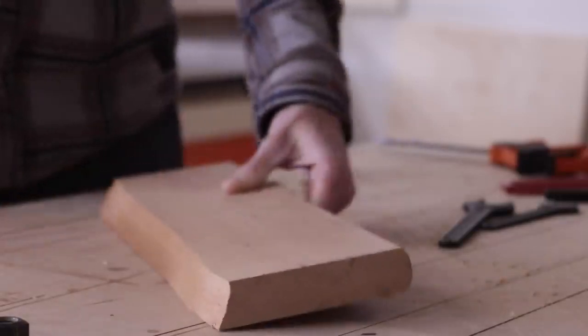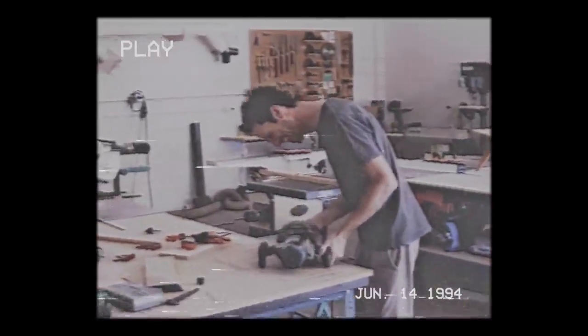It's a technique I've come to really like using, and I've used it on all sorts of different pieces. I remember when I first started making nicer pieces of furniture, if it still had sharp edges it would almost look unfinished to me, so I'd grab my quarter-inch round over bit and go to town. So it was really a nice compromise to start using this thumbnail profile. To me, it has the softness of a round over while still maintaining the crispness of a sharp edge.